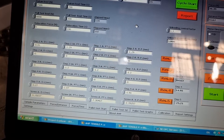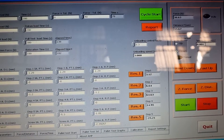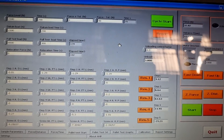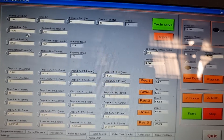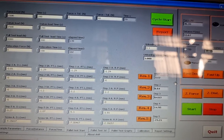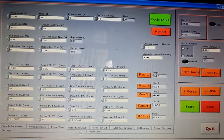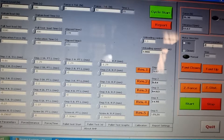Now I'm going to do the strength test. I need to set the speed, set the direction to down, and start from here. If you want to do a stiffness test you need to run a cycle with the force and time parameters set, then click cycle start. For the strength test, I set the displacement cut to 78, the displacement base to displacement 5, the direction to down, and the speed to 2 mm per minute.